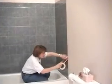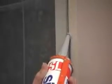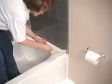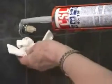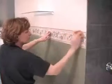What can I do if my panels have rough and dog-eared edges? It is possible to cut a considerable amount off the edges of the two end panels. They only need to extend past the shower curtain. Silicone caulking is actually rather transparent, so it is very important to apply a color matching paint to this exposed cut. Seal all unpainted areas against moisture with only the best, Barker color matched 100% silicones.